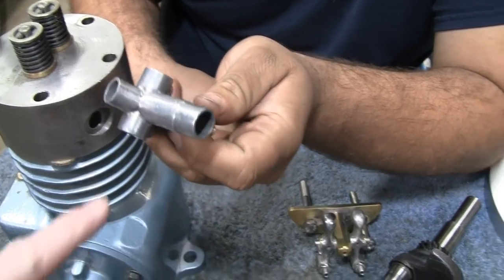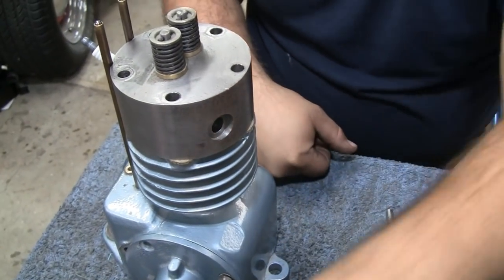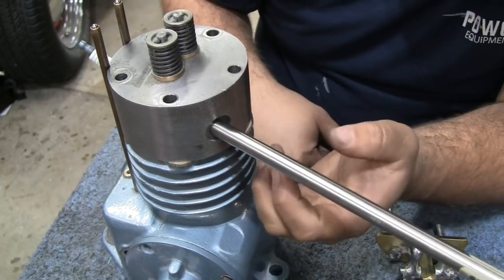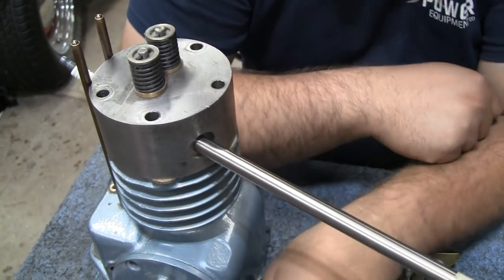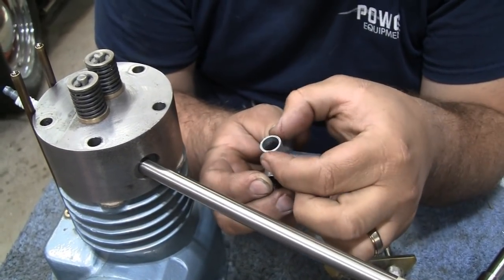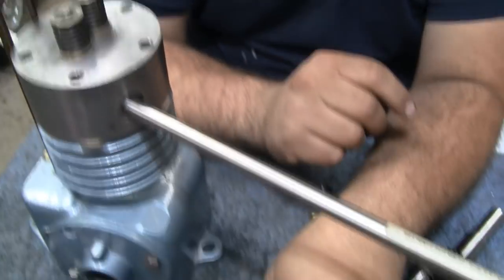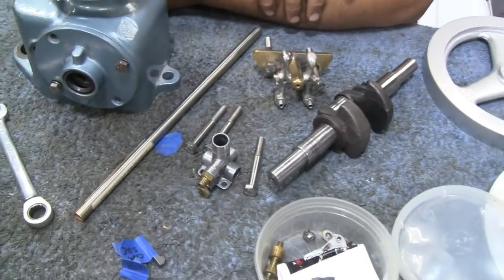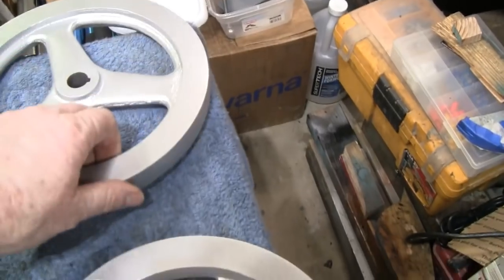To hold things in, they're going to take the head off and Mike wants to put a set screw in from the bottom to hold the pipe, since the tube is a slip fit. They'll put a little sealer on there to make it an airtight seal, and the set screw will keep it from vibrating and rotating. They'll also make a cut and clamp to hold the pot metal onto the tube.